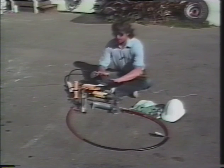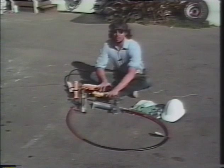There's not a lot of damage. In this particular instance, because these are sort of stuck on the jamb, it is beginning to pull these loose as we did this. Both of these are pulling loose a little bit. And if you look closely, you can see some marks where the jam spreader sat. However, for the most part, not a lot of damage. It opens the door, doesn't harm the lock, doesn't harm the jamb if it's done right. A few seconds, you're in. These are an example of state-of-the-art opening tools.